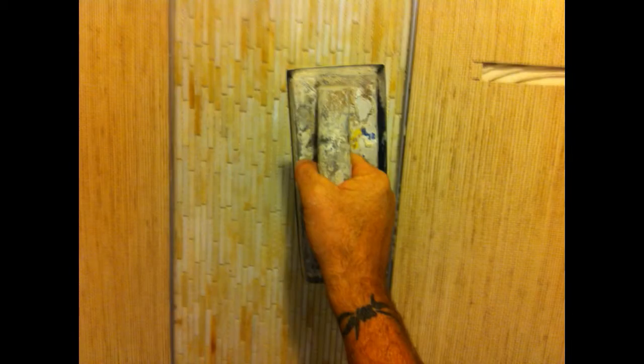Now I'm installing my waterfall. Use white thin set, and the way I make this super flat is I use a rubber grout trowel to beat them all in, just tap them in lightly. And there you go, installed. And see how that Schluter looks, it just added a nice custom little look to the shower. And the shower's awesome. Just picked out some nice stuff.